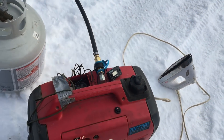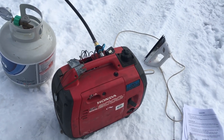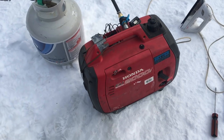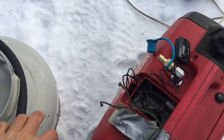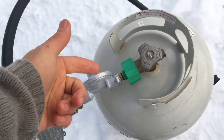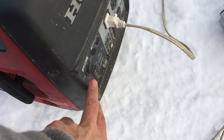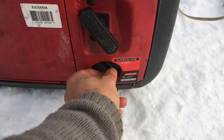I really think the EU2000 is ideal — Yamaha apparently makes a good one too, but this is the way to go. This is the Hutch Mountain kit. I've tried one from Central Maine Diesel and one from a large company in Kentucky or Tennessee. What's super nice about this one is that the whole regulator assembly comes off, so you can use the generator on its own, and it pops onto any propane tank. I'm tuning it right now with a tachometer — it's supposed to be 4,300 RPM when eco-throttle is off and 3,000 when it's on.